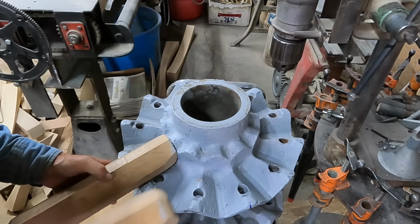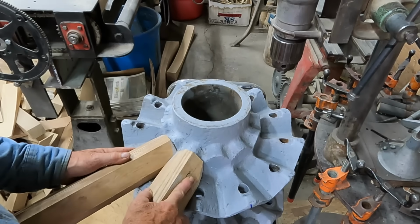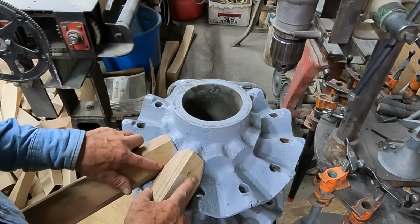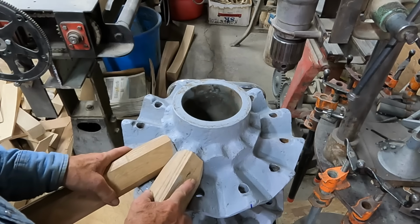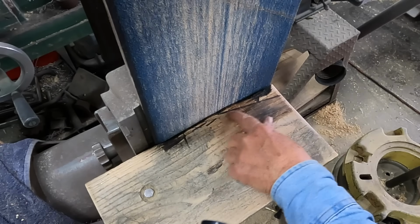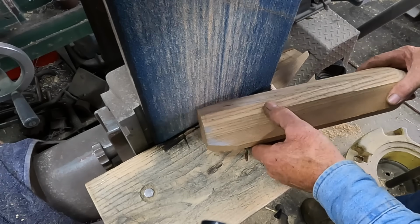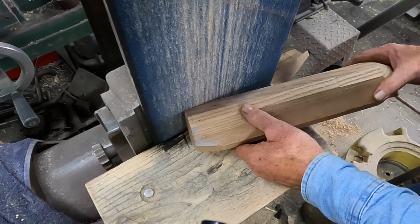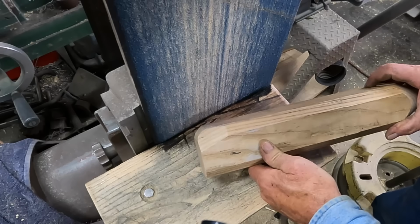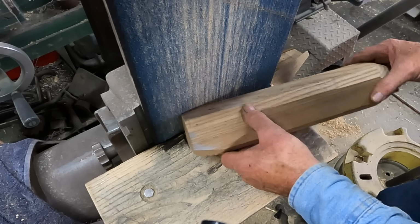So now when I put the bevel on these spokes inside the hub, now you can see where they're going to come together, not interfere with each other. So 12 spokes into 360, these are 30 degrees. So I took 15 degrees on both spokes to add up to our 30 degrees, and that seems to fit just about right. So I took a black marker and put a line here at 15 degrees as a stop reference. So as I put these in, I can run them to about there to get somewhat of a consistent angle. I'm not sure these have to be super precise. I just want that clearance between spokes.